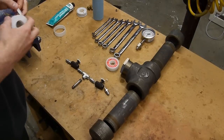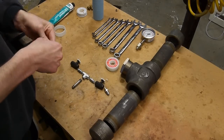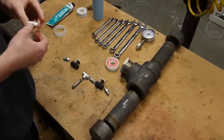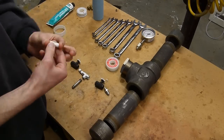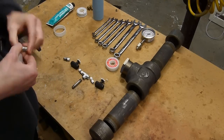A lot of people would consider this not really a DIY project because it involves a very hazardous chemical, but of course there's no magic involved, so in this video I'm going to talk about the process. The basic idea is to treat the wood with high-pressure ammonia gas, and to do this we need a pressure chamber that can hold the ammonia and is big enough to contain the wood we want to bend.